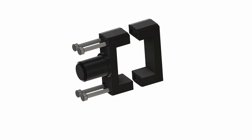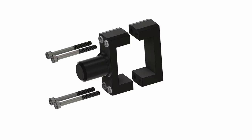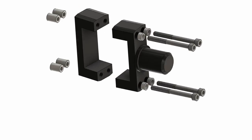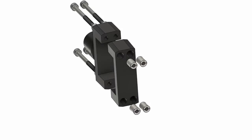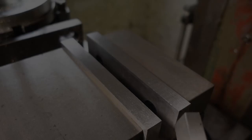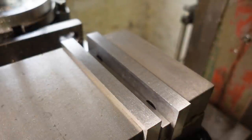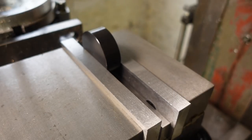This is part two of the custom boom bracing clamp project for a pair of high-gain 432 MHz Yagi beam antennas, which are to be installed 70 feet up a mast in the Netherlands. The brief is that the clamps must be effectively invisible to the radio frequency signal, so there's no measurable effect on the beam pattern or the side lobes in the vertical or horizontal planes.